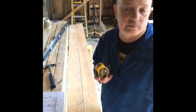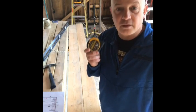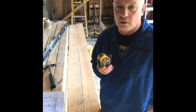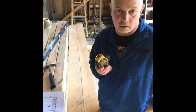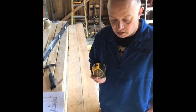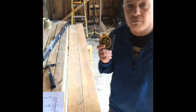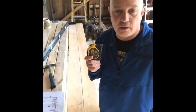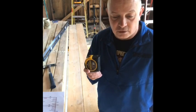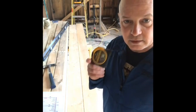There are basically two ways to read a tape. If you're in construction — concrete, plumbing, electrical, carpentry, especially framing — a lot of times everything is in feet and inches: ten foot seven and a half, twenty-two feet one and a quarter. If you're doing trim work or plumbing, you might read it in inches only: 122 inches, seventy-four and five-eighths inches.